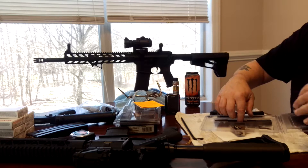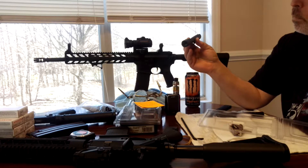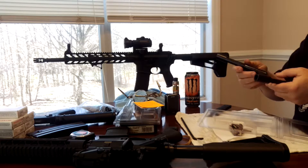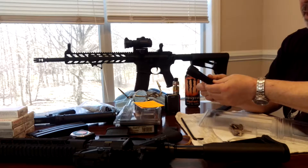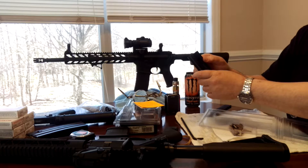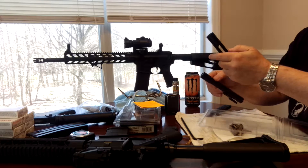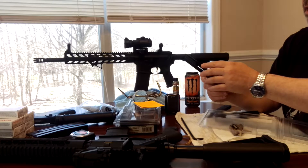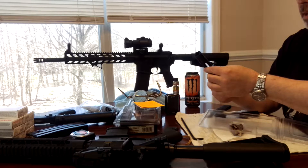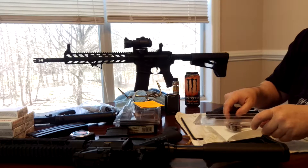You also get a bolt carrier — a stripped bolt carrier. It's very similar to an M16 bolt, except it has a slight chamfer on the rear. This right here is an AR15 bolt, and you can see how it is neutered back so it has no chance of hitting an auto sear for full auto. This is very similar to an M16 bolt carrier, with the exception that it has a slight chamfer on the rear bottom of the carrier. This is essential to the function of the trigger — it will not function without this.